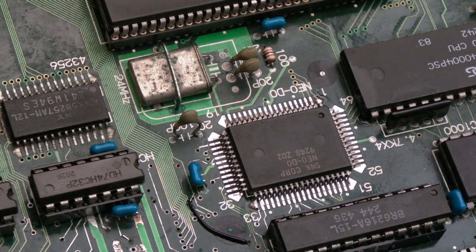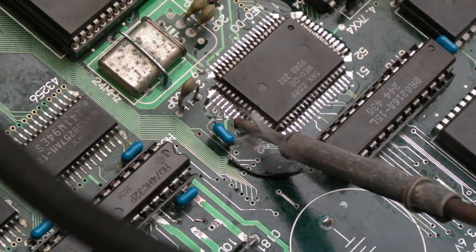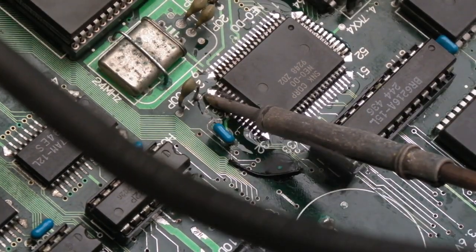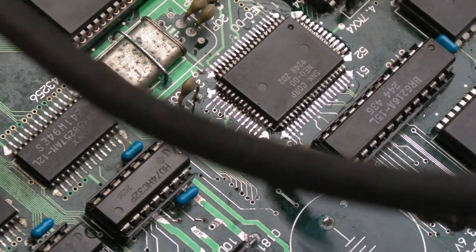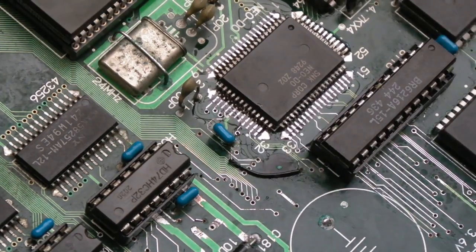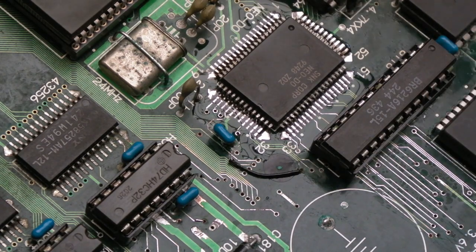So then we'll just drag solder like I did earlier. So you've got a little bit of solder on the tip there, got some flux, as you see, just drag along like that, and it's super easy. You'll often see me going the other way. I like to dab into them like this, even after I've done the drag soldering on this type of chip, because you then get nice even distribution of the solder. It's going to vary depending on the flux and stuff you're using, but hopefully you can see how easy that is. It took, you know, a few seconds to do one side.